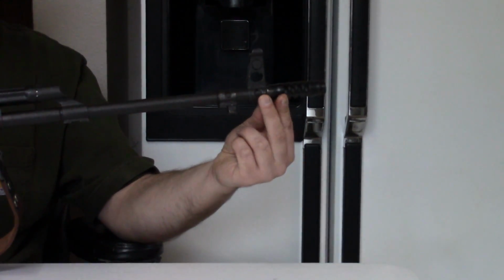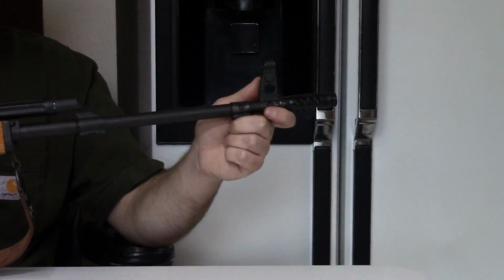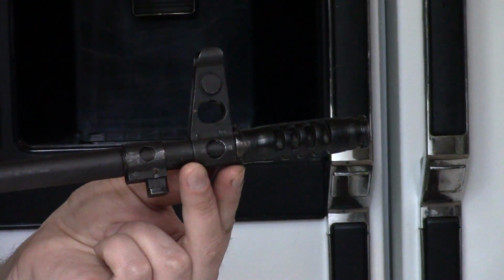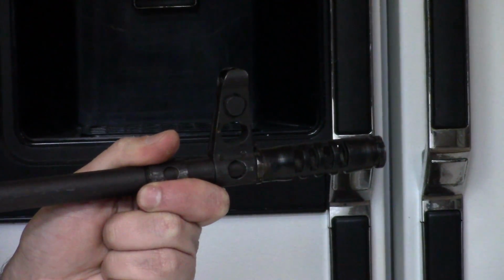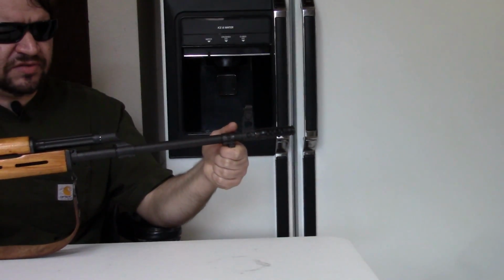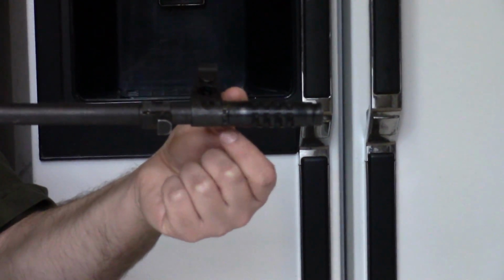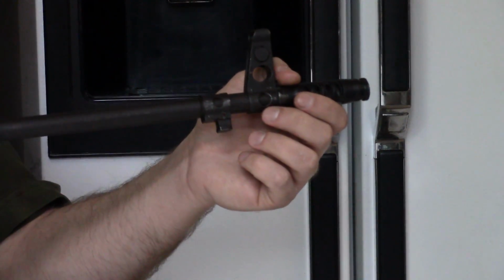For the muzzle devices, like I said, many had the fixed pattern. Now, I saw a good number come over from Century, especially, that were threaded and were not tack weld. It seems like they only caught on to the fact that they're starting to send these over with the threaded, removable device, as opposed to the fixed device, only after several months of bringing them over. So later ones, they would just blob a very ugly weld. It was actually a very soft steel because it was put on over the finish. I took it off on this one because it was just bleh.